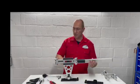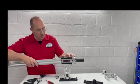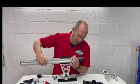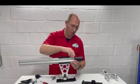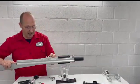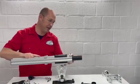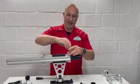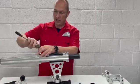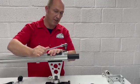Connecting another extrusion is easy too — you just slide it in here, keep it equal with the tool, put the other one in, then use your allen key to connect it through the cage. Tighten it up and don't over-tighten — just snug it, and you have a solid tool.